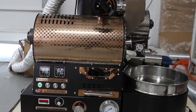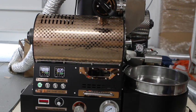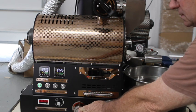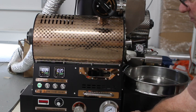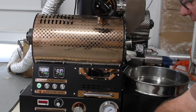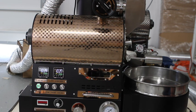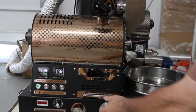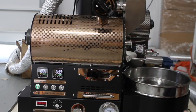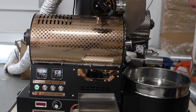Going back to our running unit — here you can see the light switch for turning the light on and off, along with the control panel. This is your needle nose gas valve and this is your gas gauge. Generally on an LPG model, people want the 6 kPa model; if they go natural gas, which is a much lower pressure than LPG, they may want the 2.5 kPa gauge. There's also a debris tray because there's a little space between the drum and the front plate to allow for expansion — it can easily be emptied out.